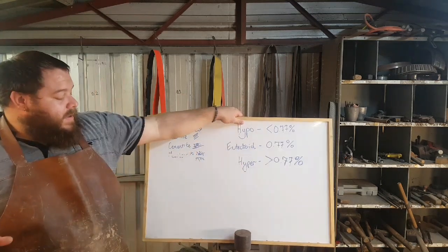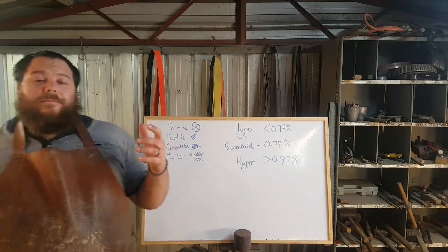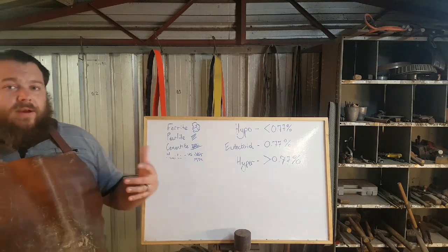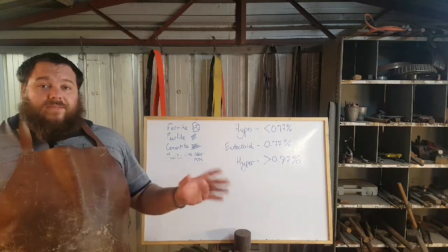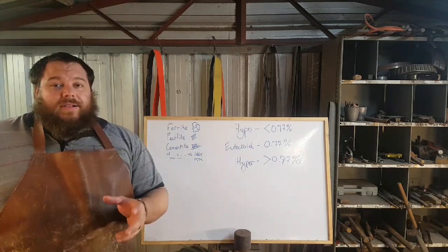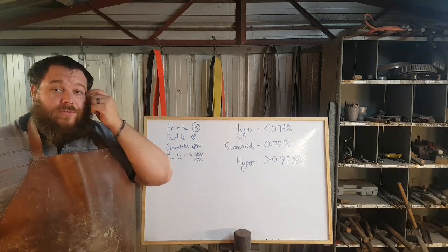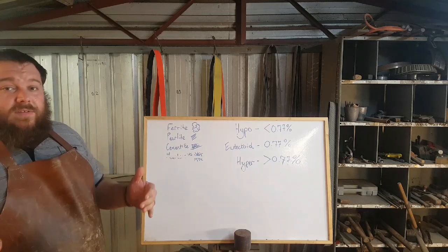You've got hard material surrounding pearlite, surrounding that soft material, which is why when you try and drill hypereutectoid steels, even when you've annealed them, or in this case normalized them, and normally if you anneal them they're easier, but even when you normalize hypereutectoid steels, you can develop carbides. You can develop that cementite. You can also get carbide clusters because you've got so much extra carbon, especially in the much higher carbons, the 1.1, 1.2% carbon, right before the cutoff to cast iron becomes evident. You get even more chances of forming carbide clusters.